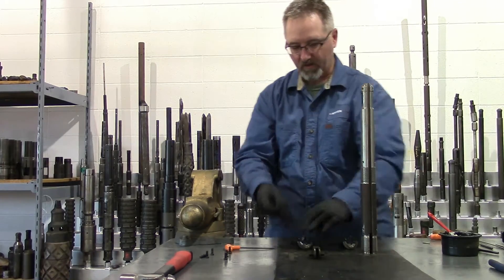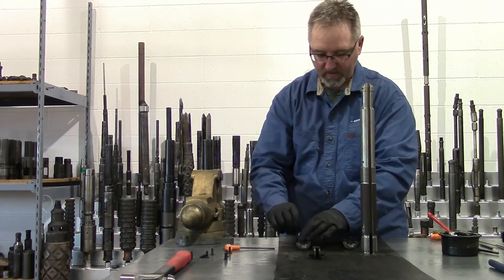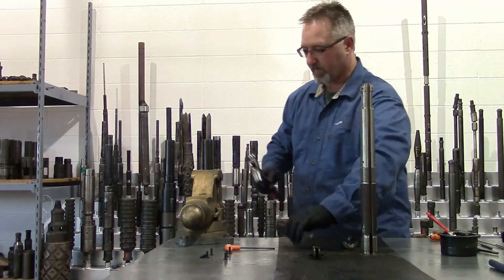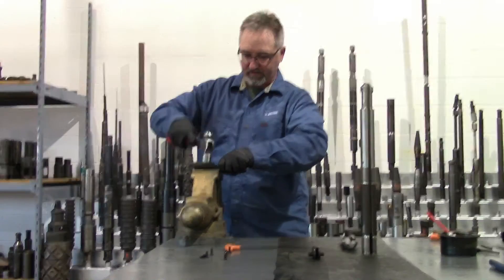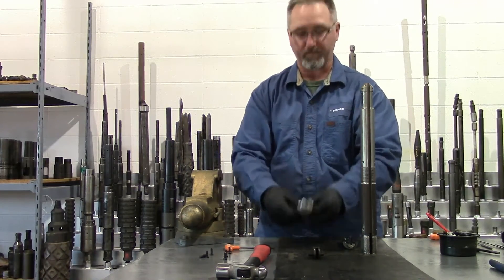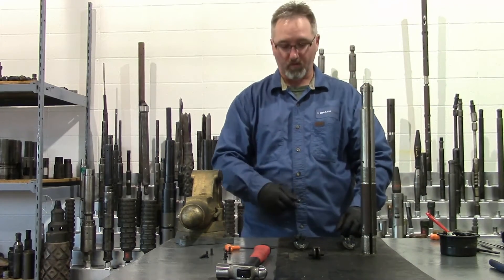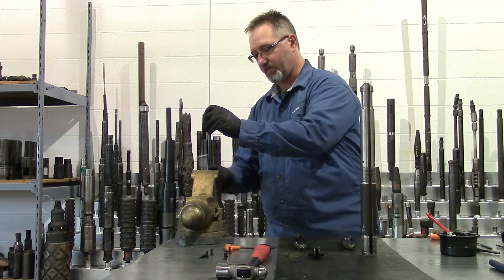When you want to run this, you'll put your bean in and pin the bean in place before it ever gets near your slickline. We use a 1/8-inch shear pin. We're going to run this, drive that through the pin, the piston itself, and into the body so it holds it in place. There are two pins and typically we recommend that you run both pins, but for this application I'll just put one in.